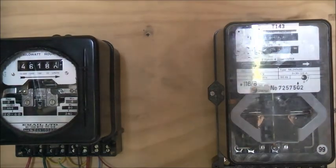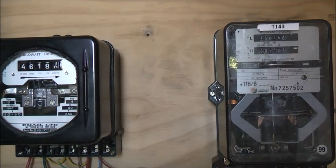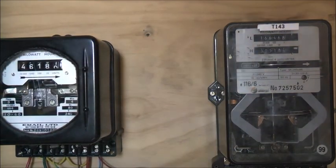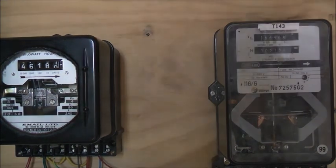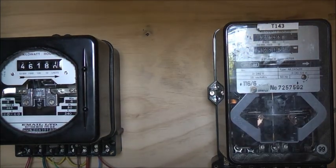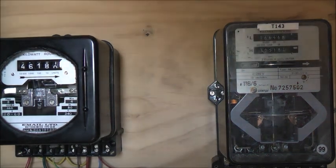Potential on. Variac on. I'll get my clamp meter out and make sure there's no shorts anywhere. Alright, let's proceed with a test. I've got about 30 amps. I thought it was a safe test so I won't put too much load on anything. 40 amps.